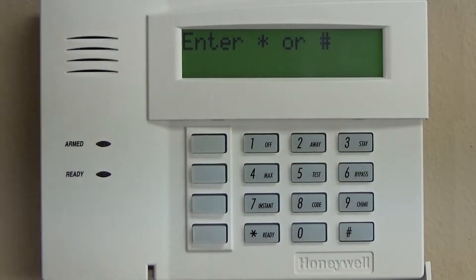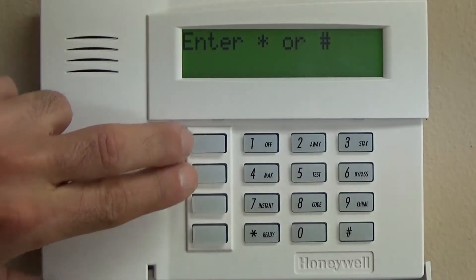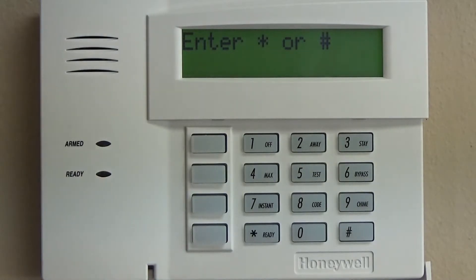Basically what we did was take care of the first eight and the last three zones, which are the only ones that typically come with any programming done to them. So right now we have a clean slate, and we know that when we program these zones or these buttons here on the side, we already have police and fire enabled — it's just one less thing to go back to. This is just one way to do it, not the only way. This is the way that we program systems, and hopefully this will help you with your learning curve.